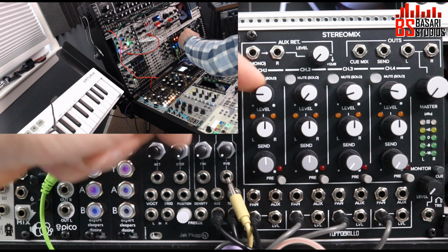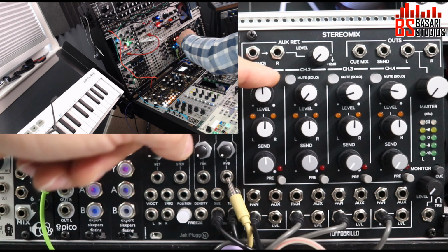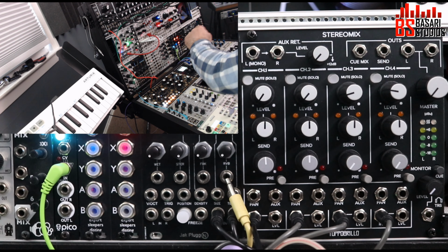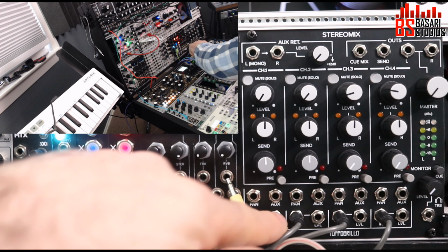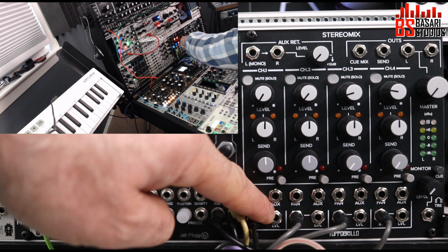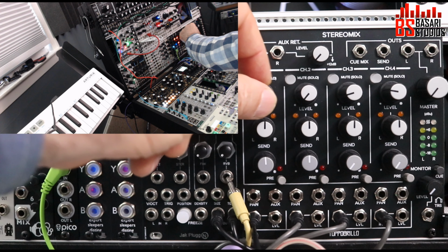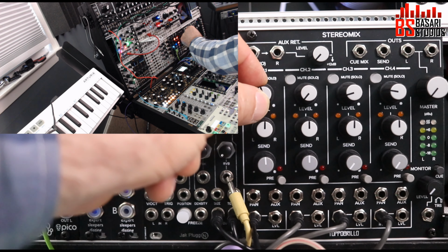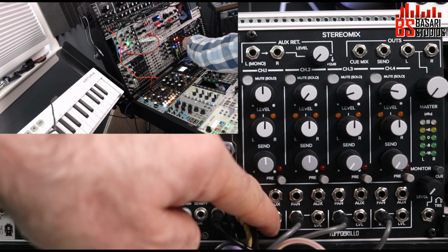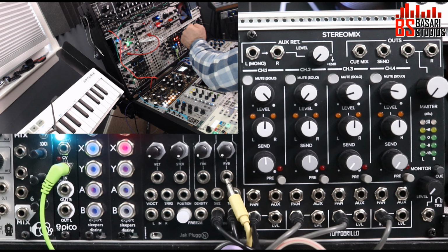What's happening is, I wish this, same as the send, to be stereo, I wish this was not summed, but it's also useful as summed. If you run an envelope straight into the level, it's a VCA actually. But what happens is you cannot use the knob to mix the signal. Because the knob is summed, you're going to get this animated signal by an envelope from the level input and also the knob level going up as a drone.